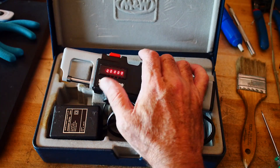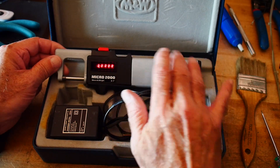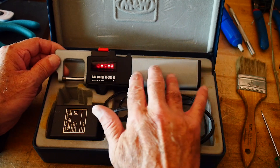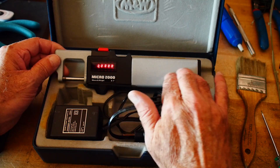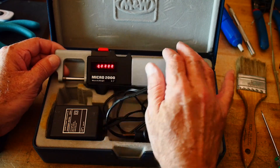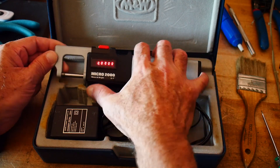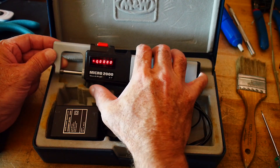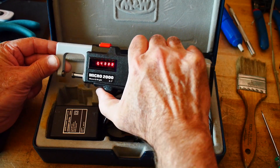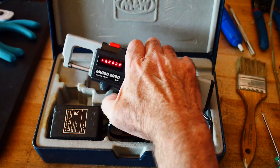So it's super, super accurate. It works on optical technology — it has a grating in it and light bounces off that grating. As the sensor moves back and forth across that grating, it gives little ups and downs and does the measurement that way. It's actually still useful because it's very, very fast — much, much faster to use than just a normal caliper.